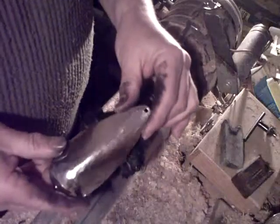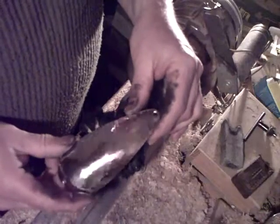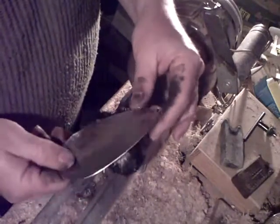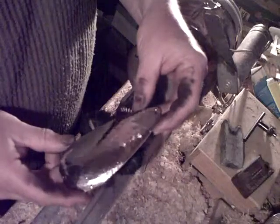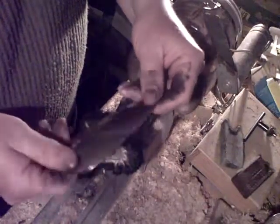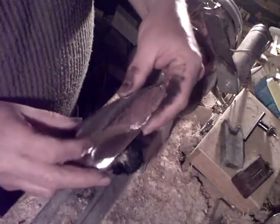The polishing of this spoon is done — you can see it shine now. If you want to apply some foil onto it, you must wipe it with alcohol. I would clean them with mineral spirit anyway because my hands got quite dirty from the polishing paste. You have to clean up thoroughly with mineral spirit before you continue working.